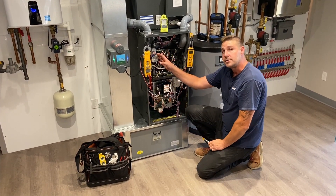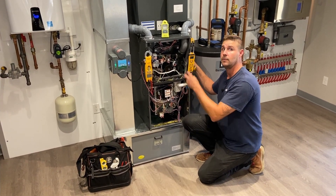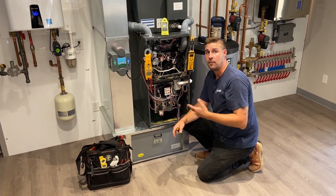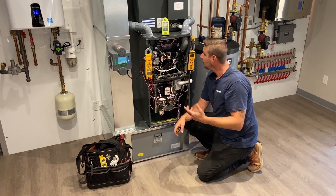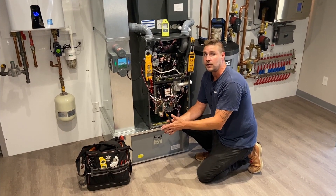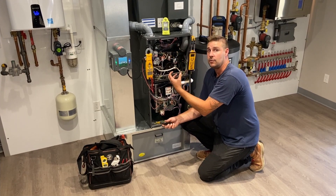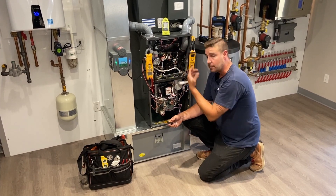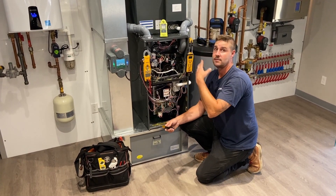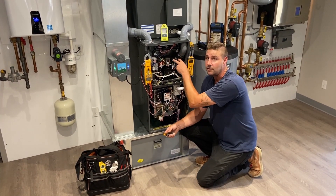We also test your gas pressures just to ensure that you are getting optimal gas flow through your burners. Inspecting your burners and what the flame color looks like is also very important. Visual inspection is essentially what we do with every furnace service. If we notice that there's something off, we will have to go further — pull the burners out, see what's going on, check for any blockage or clogs, and then take a look at your heat exchanger within the unit with a camera.